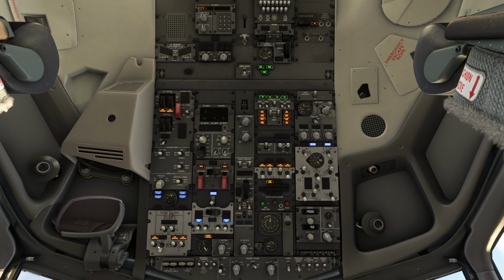The APU is typically run off of the left forward fuel pump. While the APU can suction feed fuel, it is better for the life of all system components if it is provided fuel under pressure from the left manifold. This can be via either the left forward, left aft wing tank pumps, or the left center tank pump. However, keeping in mind the restriction on transferring AC power with a center tank pump on, we generally start the APU on the left forward fuel pump.